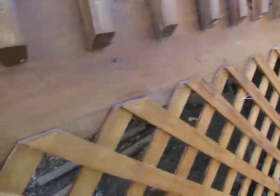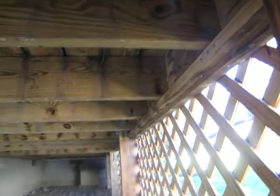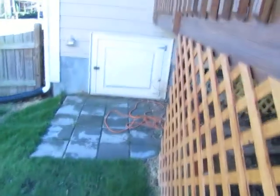It's kind of double and kind of not. The way I say that is: you can feel a ledger board. It's not double — it's a ledger board holding up the joist. So we've got to get a second 2x10 in there to bring it up to code. You can see five-eighths galvanized hardware.